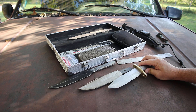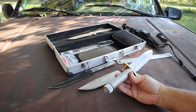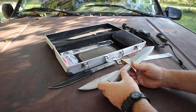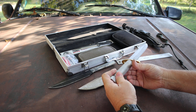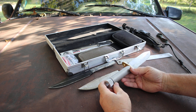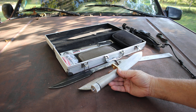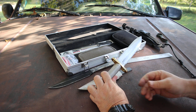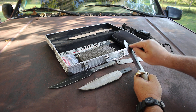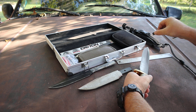What I'm really trying to get better at is fit and finish — that seems to be kicking my butt right now. Along this hollow handle, I use liquid cold weld. I try to be really clean when I apply it — I put it in with a syringe — but if it gets anywhere and dries, even a little spot means you spend 20–30 minutes trying to remove it. It's all a learning curve, and these knives are getting better, but fit and finish is my weak area right now.